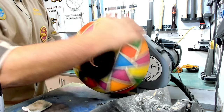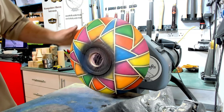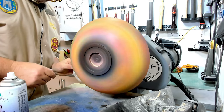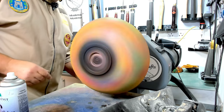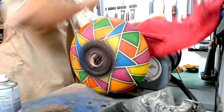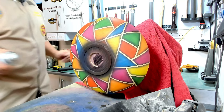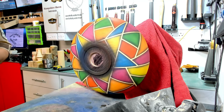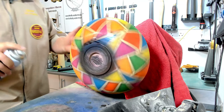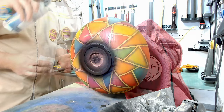Just taking the grain down a little bit. What we're going to do now is give it a couple of coats of sand and sealer, build up the sand and sealer on it, then de-nib it again, and maybe give it a couple more coats of sand and sealer so we build up the seal on it. Then when we come to finish it, it will be much, much better. So let's cover our lathe up and protect it.